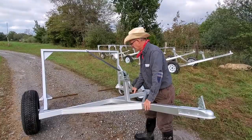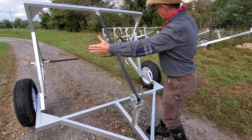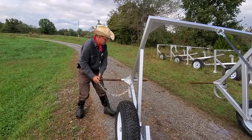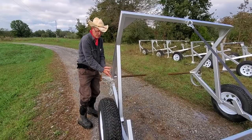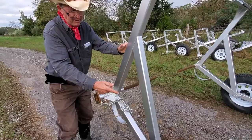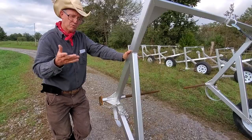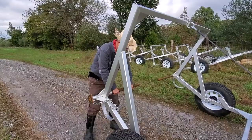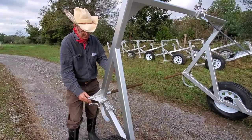This is a geared boat winch. The way this works — you back up to your bale, you pull your spikes out, jam it in your bale. Slap it into the center of your bale. Put your hook on there — that keeps this from backing out. This little deal right here is called my foot. As the bale's being unrolled across your pasture or through your woods — stumps, rocks, frozen cow manure, whatever — if you've got this spike and it's rolling out and the bale is gone, and you hit something because this is laying on the ground and that foot's not on there, you're going to bend that spike. With this foot on here you can't do it. It won't go any lower than that foot, so it protects your spike from being bent.